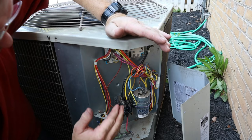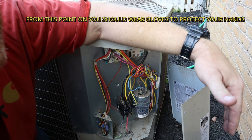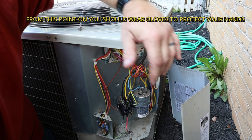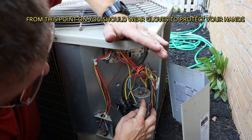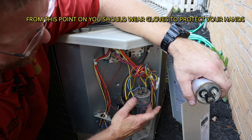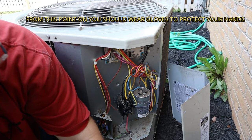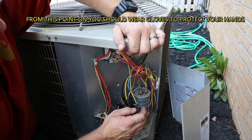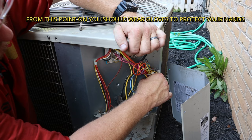This is my starting capacitor. This is not a full tutorial video — it's more to show you that if it's the weekend and something's going wrong, chances are really good it's the starting capacitor. While you're here, it's not a bad idea to check all your terminals to make sure they're tight. When you get ready to take this off, be extremely careful — this capacitor stores energy. Make sure you know where each wire goes, and take a picture if you need to.